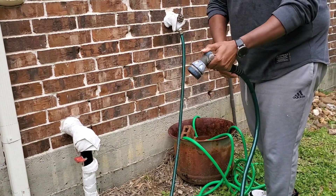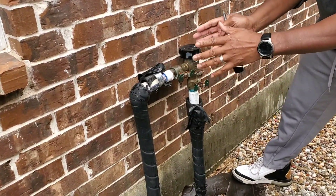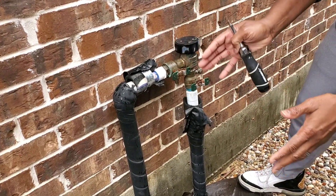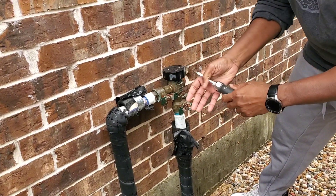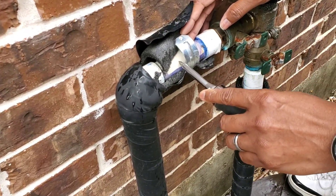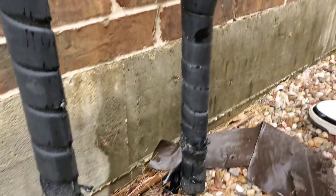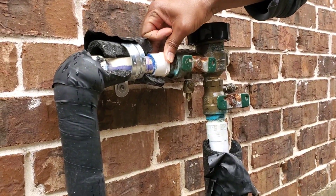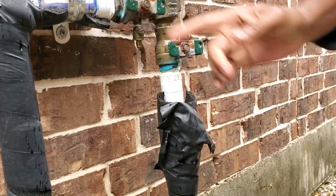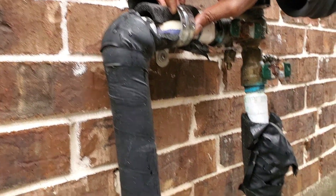All right, now we're ready to begin. The water's cut off and I have all my tools. I also had to get a screwdriver because I have something in the way. Looking at this, I went to Lowe's and the guy showed me that all I had to do is cut this existing pipe right here in the center, couple it right there, and do the same in the midsection. I'm going to unscrew these pieces from the pressure vacuum breaker, salvage them, cut somewhere in the center, and put my coupling there — put some cement glue, glue it together. Do the same thing at the bottom, and it'll be a quick and easy fix.